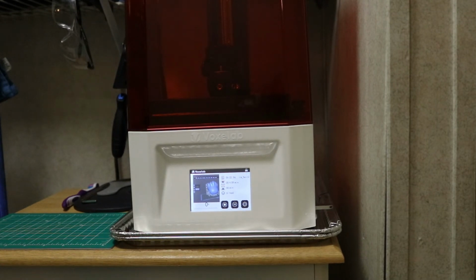Another thing to note is within the documentation in the books, as well as the videos online, you're supposed to only turn 2 screws to loosen the build plate to level it. However, what I've discovered is that's completely wrong. There is a 3rd screw in the back. You gotta loosen this one all the way. Then you can tighten it after if you wish to, to help stabilize it a little bit more. But there is a 3rd screw, and you either gotta loosen that all the way like I said, or loosen it then retighten it once you get it to a position you like. But that screw needs to be turned or you're not going to be able to level this bed at all from what I found out.